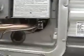If it starts igniting, it means it went out. Push it in. It senses heat and it'll quit igniting. And actually the pilot is back in here. Okay. Alright, once you do that, it's lit, it's burning. We're gonna come right here, push down on the knob a little bit and twist it down.